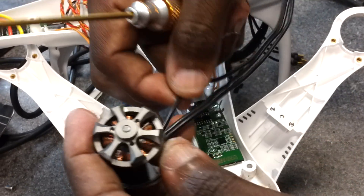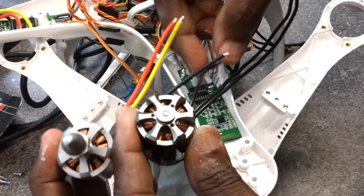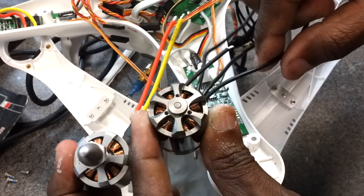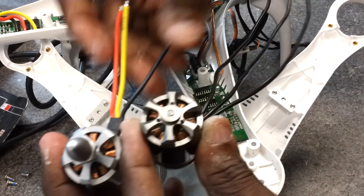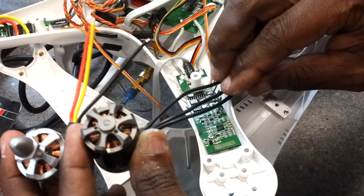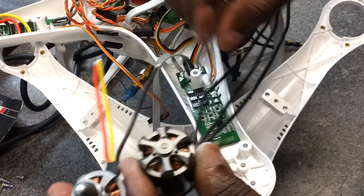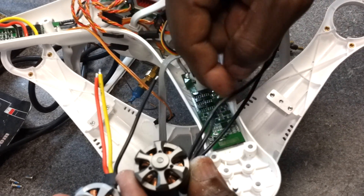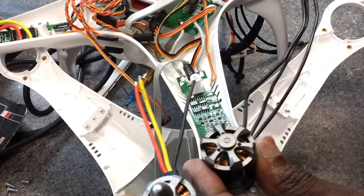Just in general, you're going to pretend that on the motor the outer wire is red, the inner is yellow, and the far left one will be black. Pretend it's the same color combination and solder those three down. Check your motor rotation — if it's spinning in the opposite direction, unsolder one and two, switch those, and solder them back. That will reverse the rotation of the motor.